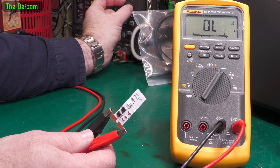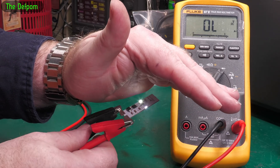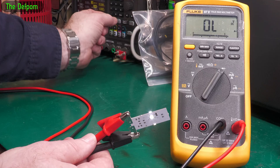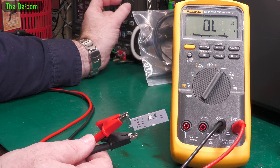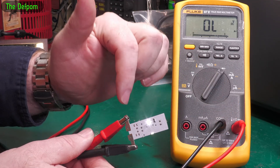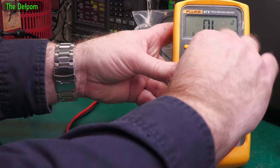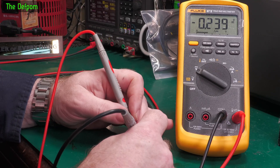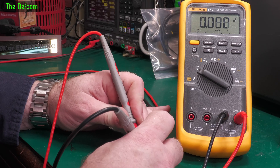Let's turn this on. I've got this set to 10 volts right now - nothing really happening. Turn it up - this is supposed to be a 24-volt system. At 13 volts you can see all the diodes lit up. I was actually testing this before and it seemed to work okay. I was thinking that's a bit weird, and I left it on for a while and it started to play up. You can see that flickering there - that's at 16 volts. It doesn't matter which way around you put these clip leads - it's not the bridge. I've eliminated the diodes by checking the voltage drop across them.